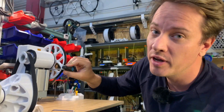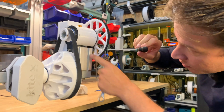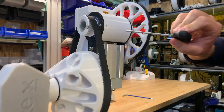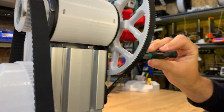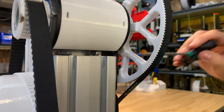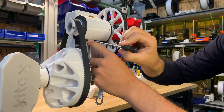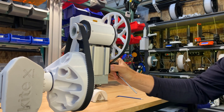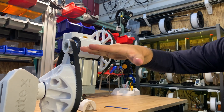It doesn't really matter — you can readjust this later on anyway. The screw in here is going to rest on the back screw here, and then I'll take one bolt over here and just slightly tighten this one down. Not super tight, but just a little bit to gain some friction on this side. Because when I start pulling this one up and there is no tension on this belt but a lot of tension on this belt, the whole thing wants to lever up.